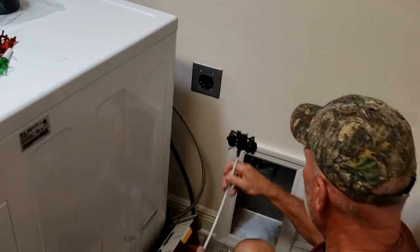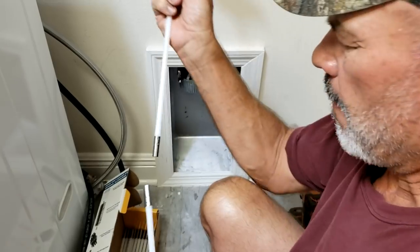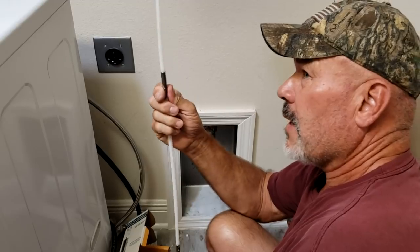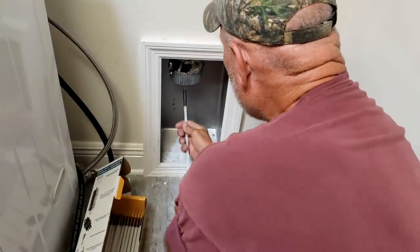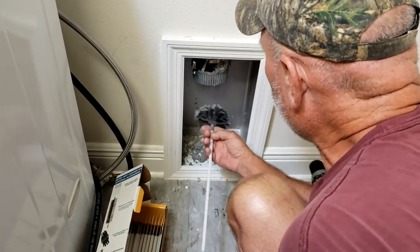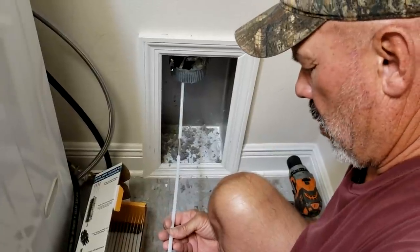You take this one section at a time — they're flexible lines, flexible pieces of plastic, and they'll be inserted up. The brush is the same diameter as the ductwork. I'll start with putting two of these together. Something very important to remember: never put your drill in reverse when working with these, or you'll end up with a section stuck where you can't get at it and have to take it all apart. So that is imperative. You can see already, just in the first foot we're in there, how much is coming out. By the time we get all the way to the roof, we will have a lot. The Blue Sea Kit does have a cap that goes over that pipe, and you can hook your vacuum right to it to eliminate the mess. But we wanted you to see what actually comes out.